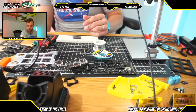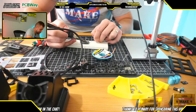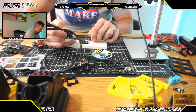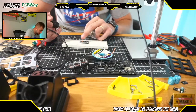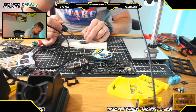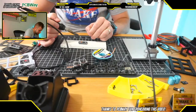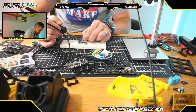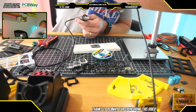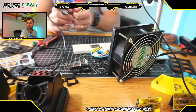A Raspberry Pi obviously gives you the advantage of having an HDMI out, so it can drive a full HD display very quickly. But the problem I personally think with the Raspberry Pi is that you would basically need an SD card that runs a full Linux operating system on board, and that can be okay, but having to install an operating system for what's essentially a macro keyboard, I thought might be a little bit too complex. But that's up to the individual. So this project could certainly be remixed using that, but I decided to use an Arduino.